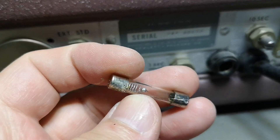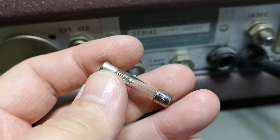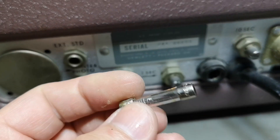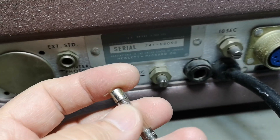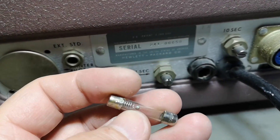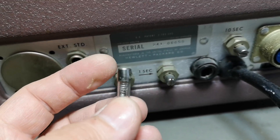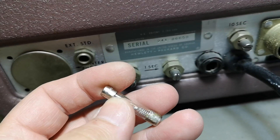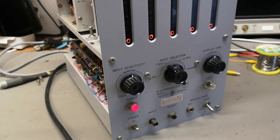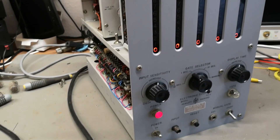How do you like this fuse modification? Somebody blew the fuse and then they just soldered a thin wire over the fuse. I don't like this at all. I think I need to open it and inspect the voltage selection and of course put in a properly rated fuse. I've got no idea what kind of amps this is — it's definitely not any approved value.